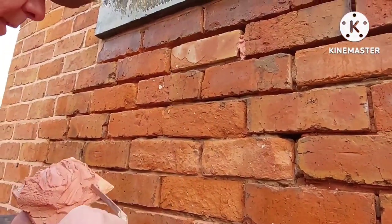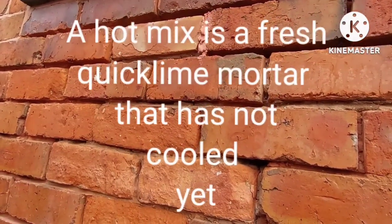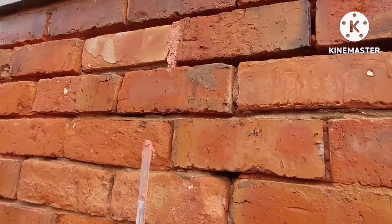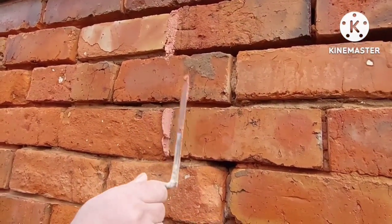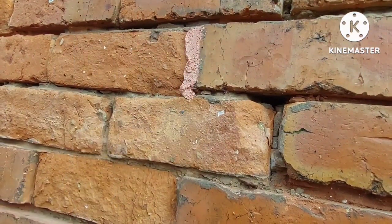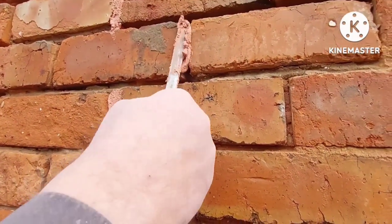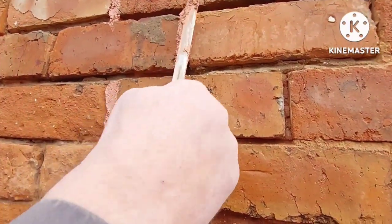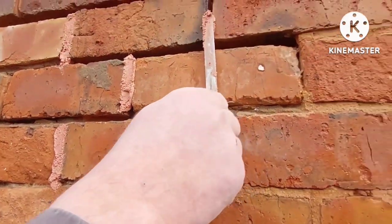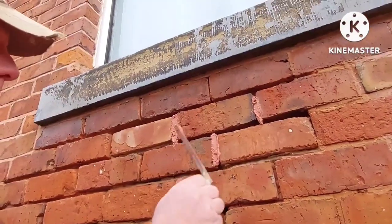This is a hot mix quick lime mortar — sticky as sticky can be. What we've got to do is get it pushed right back into the joints, like so. Now the secret when you're doing this is not to do it smooth — you don't want it smooth because smooth is bad. Once it's set in, we give it a good whack with a churning brush which will push it back and compact it all. But you've got to make sure you've got enough in before you do that, because if you don't, when you hit it with the churning brush it'll just disappear to the back of the joint and you'll end up filling it again.